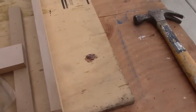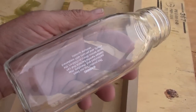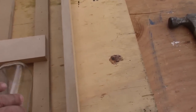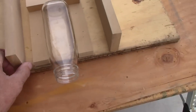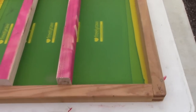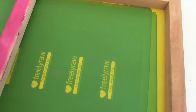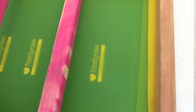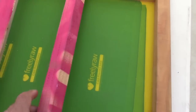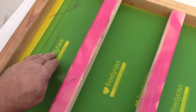We printed the bottles the other day on a Friday. We printed this warning label and did about 500 bottles in about three hours. The ink kept drying, so I had to keep cleaning the screen. So on this design, rather than try to do five at a time, we're going to do one at a time. I'm going to put super glue on this and actually make two screens out of this one screen.